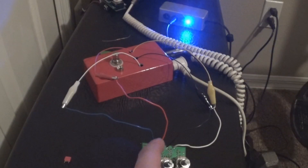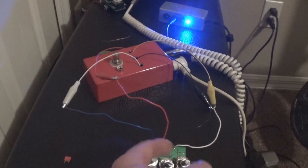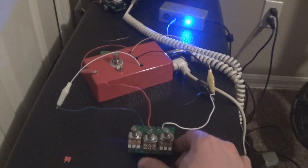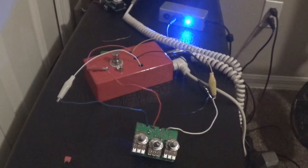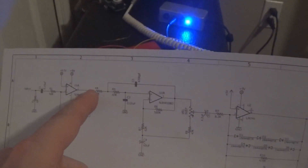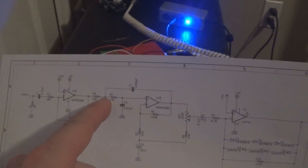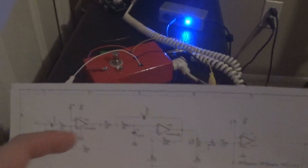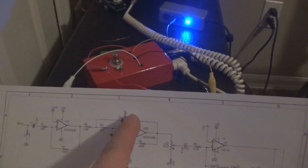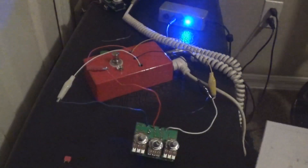We're back. Did a little bit of wire tweaking to make sure all these wires on the other side are cleaned up. The guy who built it had a staggered layout that bothered me - all the wires have got to come out the same way. Anyway, we already looked at the schematic and saw that from the input up to here we're good, and then something started to go bad. Looking at the actual components on the board, I noticed that C3, which is listed as 4700 picofarad or 4.7 nanofarad...